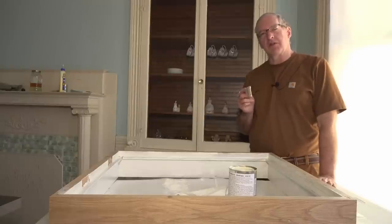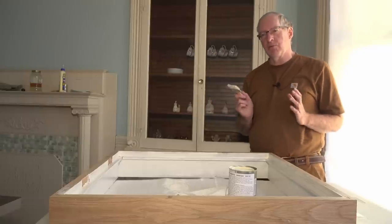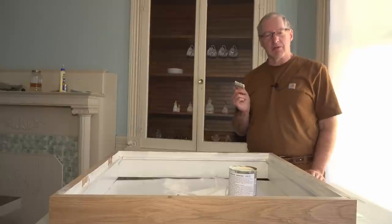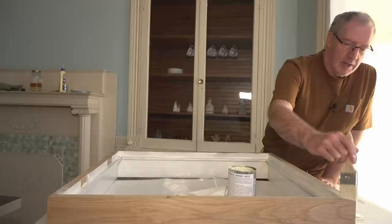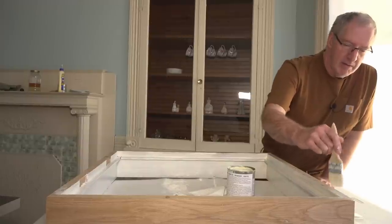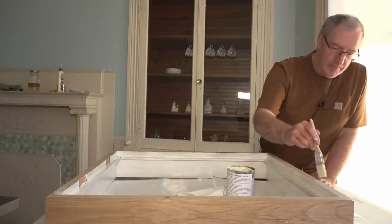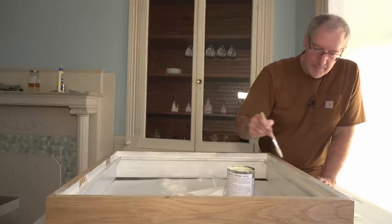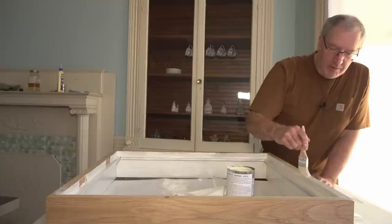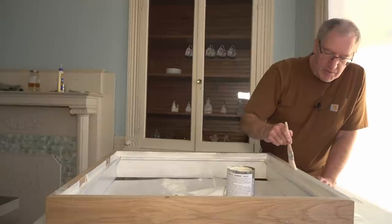Your dentist is always telling you to brush properly, but the same thing applies to paint. Now, you've always been told to paint with the wood grain, right? Well, that's important with latex, but it's critical when you're using oil paint. So we just want to get that brush in there, and it's okay to apply it against the grain as long as you go back and brush it. If you don't follow the grain, your oil paint may dry funny and then everybody will see what you did.